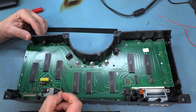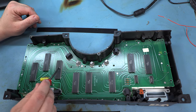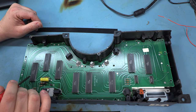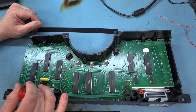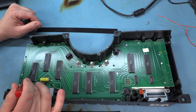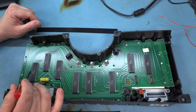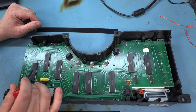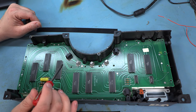Things that can cause segments not to work: these eight 40-pin ICs are LCD driver ICs. These can fail, causing segments to not turn on and off. They usually don't fail one at a time — they usually fail in chunks where the whole IC stops working at once. We don't see any instances where large blocks of segments aren't working, just a few here and there. So I don't think that's going to be the problem.